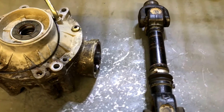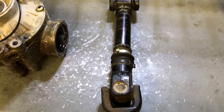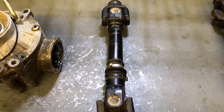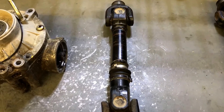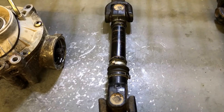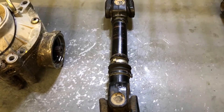The first thing I look at immediately is the prop shaft. Now when I got this prop shaft back, at first glance it looks like it's phased correctly, and it is - the splines are lined up perfectly. But there was just something about it that made me keep looking and keep digging at it to try to find a problem.